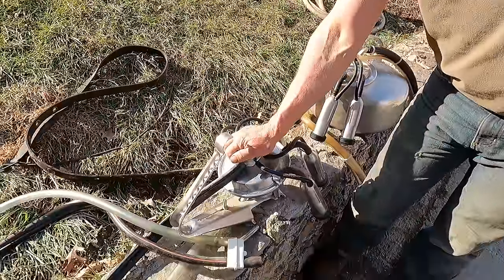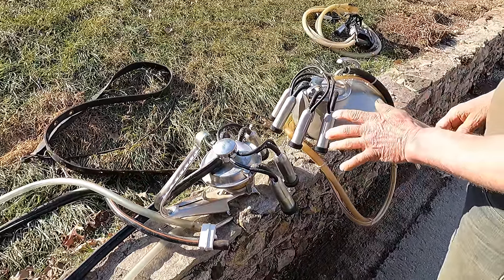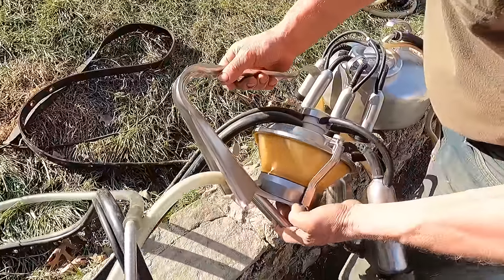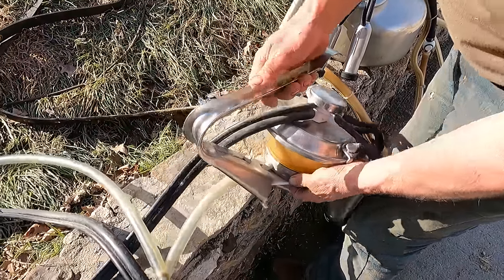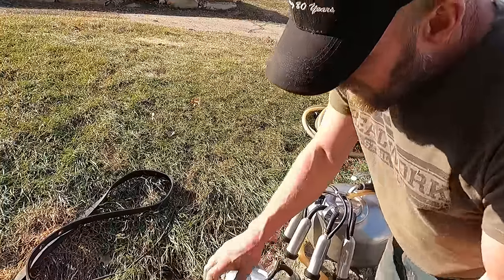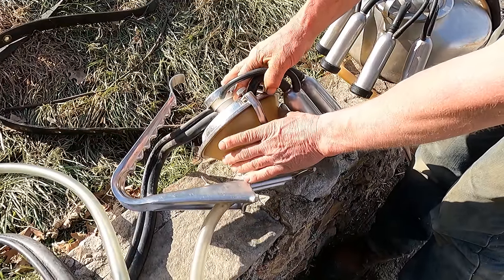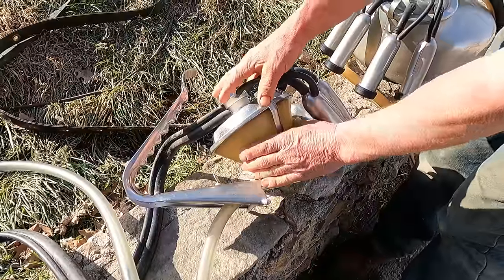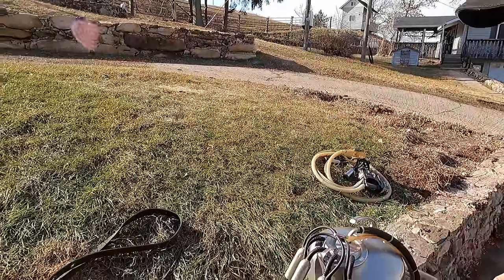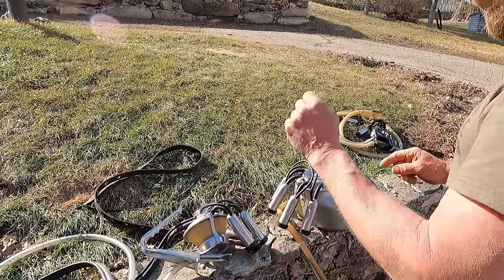When I came to this farm in 1991 we had this machine — I'd never seen it before. This is what they call the breaker cup; to me this is very close to the first Surge pipeline milk machine made. I don't know exactly what their theory was but it's extremely heavy — solid stainless steel block underneath. It weighs a little more than even this bucket when it's empty. There's a huge jar in here, and there's vacuum inside. The theory is you want your vacuum level very close to the cow's teat end to be very consistent.